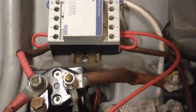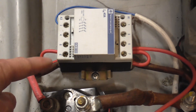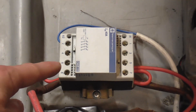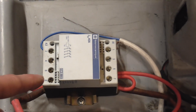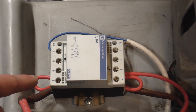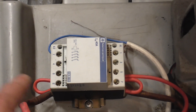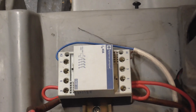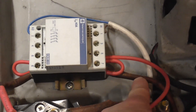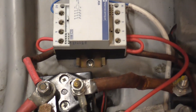This wire directly from the battery gets fed into the contactor. It's bridged across to a set of contacts — each set of contacts is rated 40 amps. The charger output is in theory 40 amps, so just to share the current and lower the load on one set of contacts, it's bridged across to the next set of contacts. The same on the other end. It's a relatively heavy brown wire — the charger wire — that runs across to the 48-volt terminal, connecting the charger to the battery whenever the charger is powered up by mains.